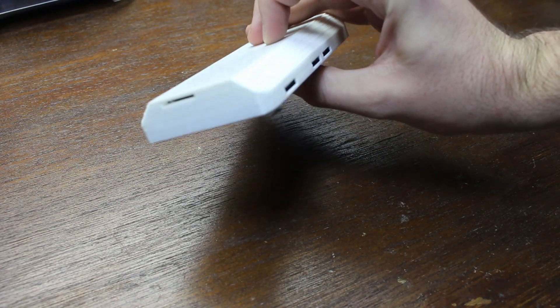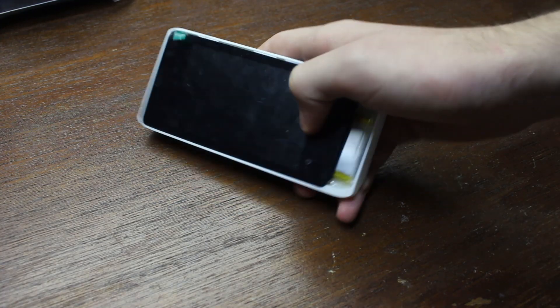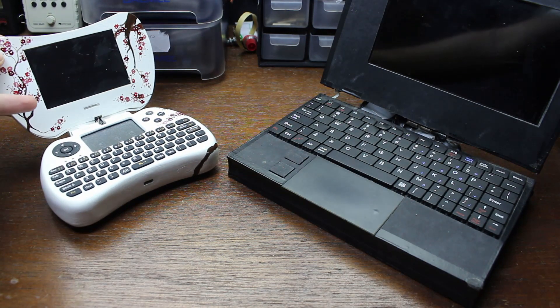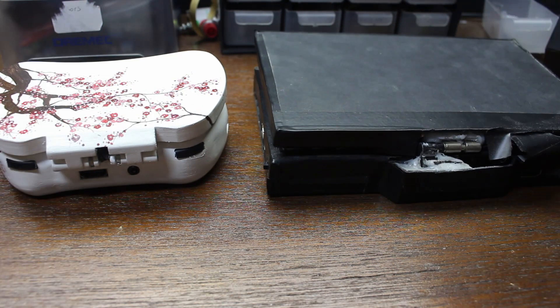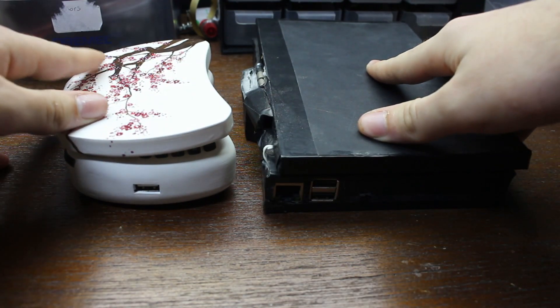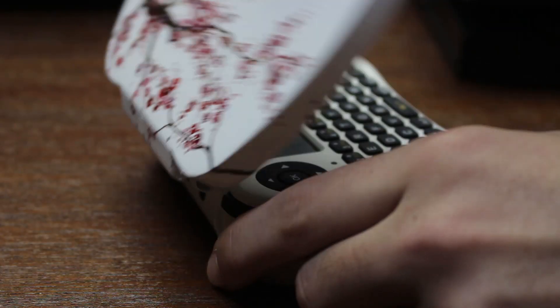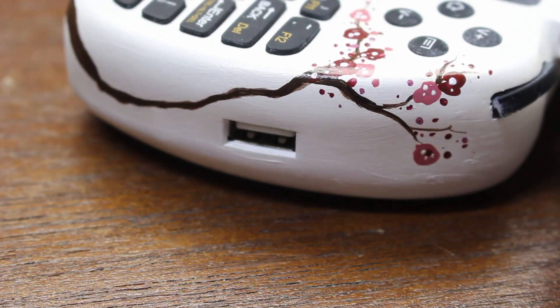So here we are, in the middle of two big projects with nothing to show for it. I figured while these shipments are on their way, why don't I make a quick version 2 of the Raspberry Pi powered laptop, but this time make it smaller and faster — partly because my printer's printing size isn't that big, and partly because I only have a 3.5 inch display in my workshop. And here it is: built-in touchpad and keyboard, HDMI and audio out, custom designed hinge, 2 USBs and a 3.5 inch TFT screen. And here's how we're going to build it.